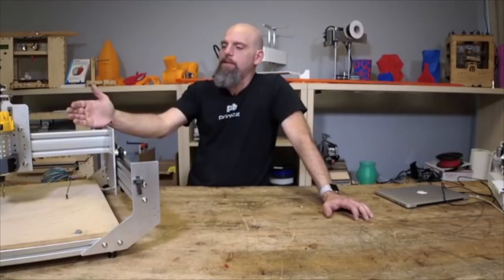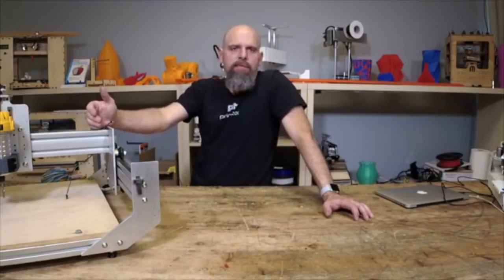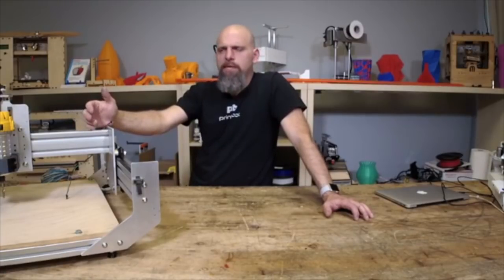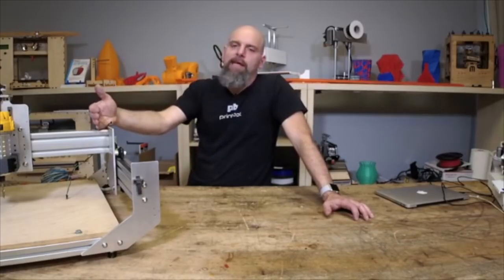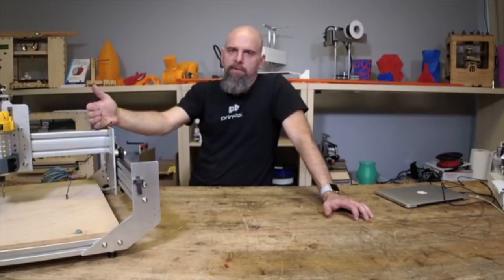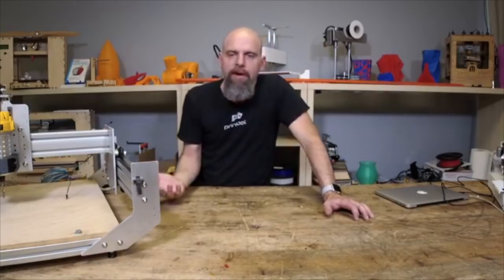But anyway, you can put rail on this as it sits, and we will be sourcing the rail to do that. Because when we did the Plus Pro bare bones and some other bare bones kits, people were a little frustrated. It was hard to find the right rail. So my requirement for Mark when he was doing the changes was get a linear rail that's accessible, available on Amazon, has a good price, and isn't some weird length that you have to cut. On the Plus, we call out exactly the size we need because if I'm ordering in bulk, it's the same price for me to get 333 millimeters as it is 400. It's weird. And I was building smaller machines, so I'd make them as small as I can.